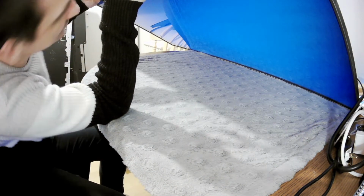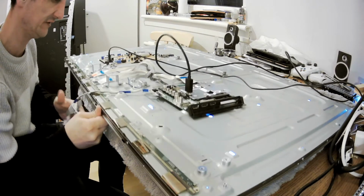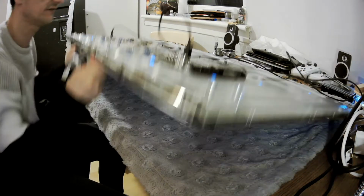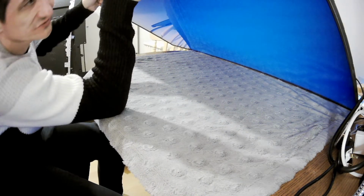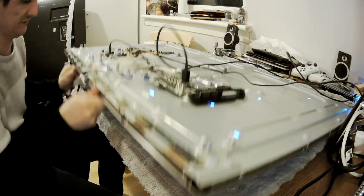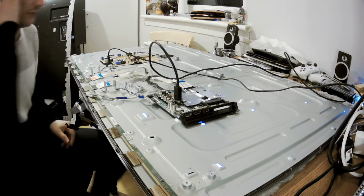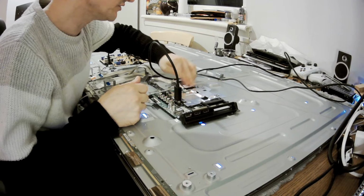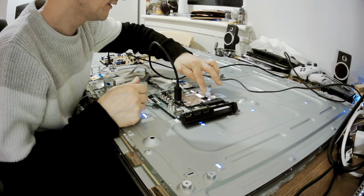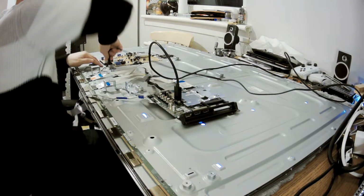Okay, it's recognizing the HDMI. That's still the same thing, so we will check the last one, but believe me, no sense anymore, because it has auto detect fine, so the mainboard features are present. Now the only problem is that it doesn't send the signal, so we need to start measuring the mainboard for short circuits anywhere. And first this mainboard has to come off and we disconnect the power.